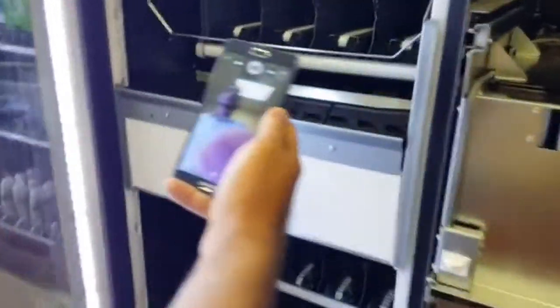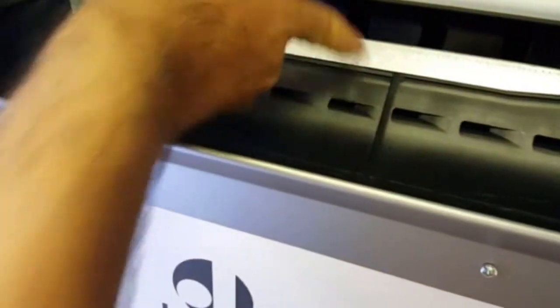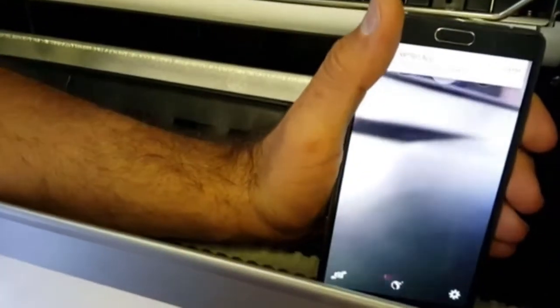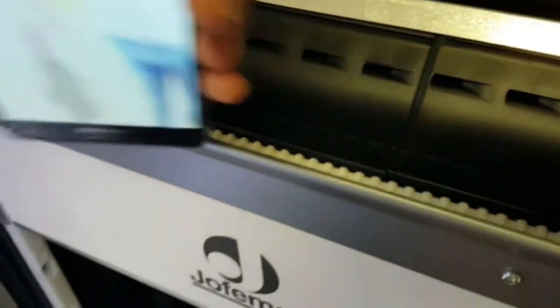Walk over to the elevator basket — see these holes on the elevator? These are the receivers. The emitters are here, pointing at those. With my front camera, I'm going to line up those holes. There should be 10 bright lights, none of them blinking, just solid light, same intensity. That way we can determine that the front sensor bar is in good working condition.